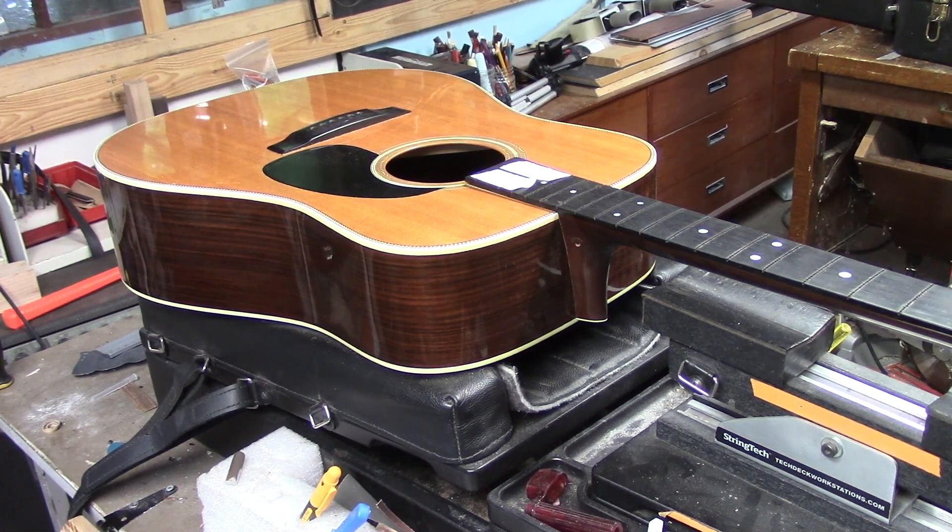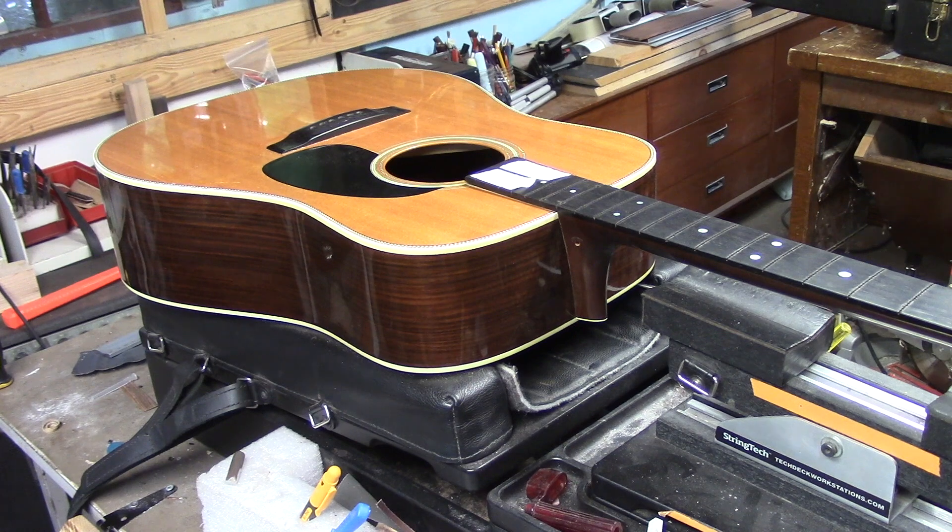As you saw earlier I had steamed the dovetail off with that jig that I put together, but I want to walk you through step by step just how involved it is to do this job. There's a reason that this is a big ticket job — you can count on spending an entire day just finessing that neck joint, because we're changing the geometry drastically when you do this. When you do it right, methodically, step by step, it will have exactly the same amount of integrity as when the guitar was made.